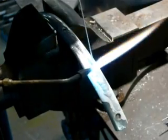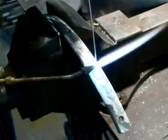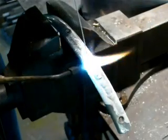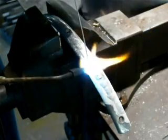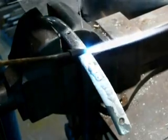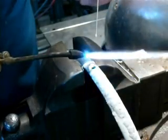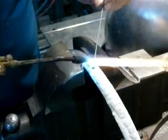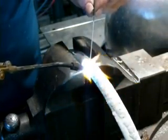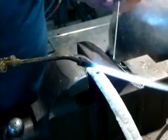So I'm just flowing this on — it just flows beautifully. The trim is very clean, no oxides, so it should be a beautiful job. It just takes a minute to get this to flow on there. This flux is non-corrosive, so I don't have to worry too much if it's not fully cleaned off the part. I do it in little dabs to not overheat the part — we're only 50 degrees below the melting point of this trim. This is where it really collided with the asphalt on landing, so it's down a bit. Now it's all built up and looks good. We'll let it cool off and turn off the torch.